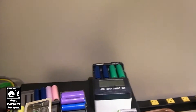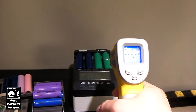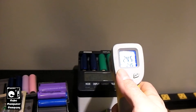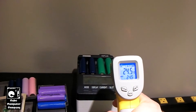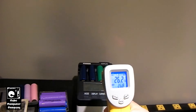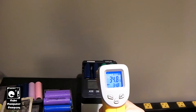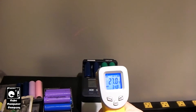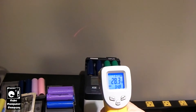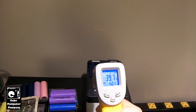They will not go up to full charge. For example, we've got these Sony cells on the right. I'll change this to Celsius for those who like Celsius — they're about 24.5 degrees Celsius. The left one is 26 degrees C. Come over to this one — you can see that one is about 34, 35 degrees. The peak there. This one, however, you can see is about 40 C.